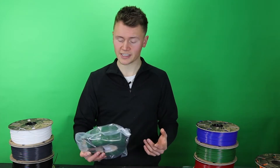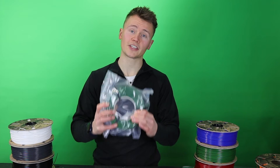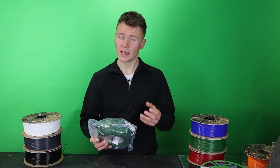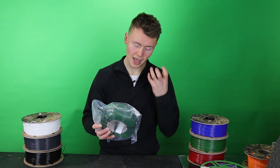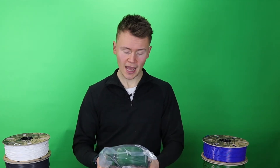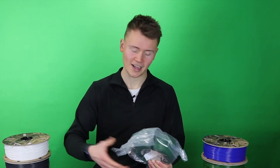Why Master Core? We decided to provide the refill actually on a physical core itself. It's slightly easier to produce because you've got a physical entity to actually extrude the filament onto. Also during shipping you've got a much more robust solution, and it ensures that filament isn't lost in transport due to falling apart.